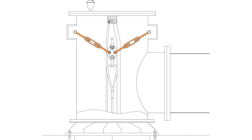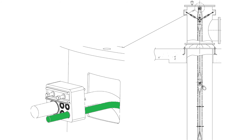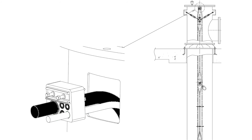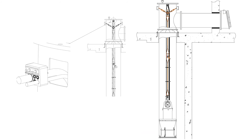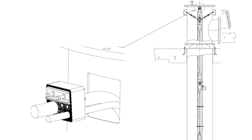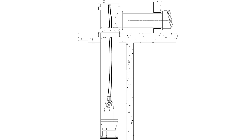When the wire rope has the right tension without lifting the pump from the seat ring, it is time to pull the cables by hand. It is important not to pull the sensor cable, but only the power cables, and be sure not to pull the cables out of the cable inlets. Tighten the rubber bushing in the cable inlet in the column tube. It is the rubber bushing that holds the cables up in the column tube, and it is the wire rope that prevents the cables from moving from side to side.